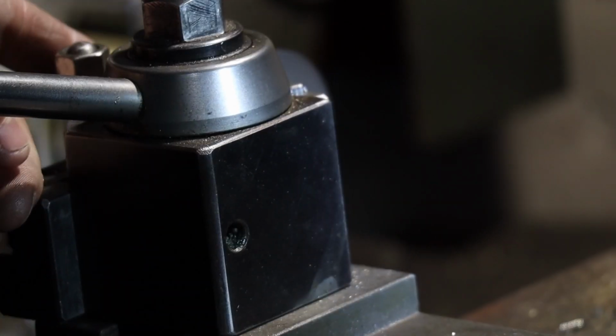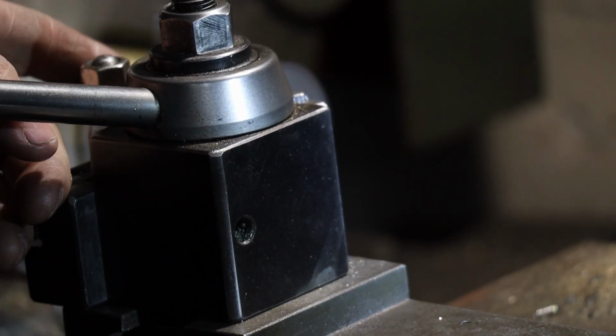Now for this piece, I'm gonna probably get it just about the same diameter as the brass. Almost seamless, if you will. Usually you'd want the auto feed so you get a nice finished surface, but I try and just do it as best I can with my hands. Try not to pause in between when you're spinning it, especially in your final cuts. You want to make it as smooth a cut as possible. It'll give you your best finish without a lot of sanding to do afterwards.